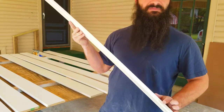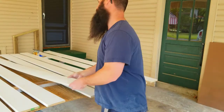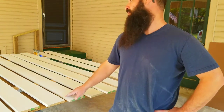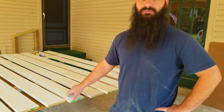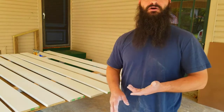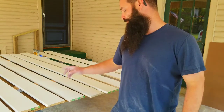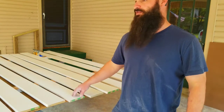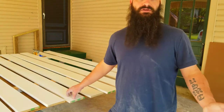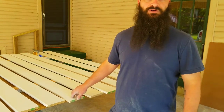There's a little thinness up top that paint will take care of. The order of operations: we'll pull the carpet, and I'm installing these just primed — I won't paint first because there are too many nicks and impacts during a carpet-removal job. We'll install it and then paint it once it's on the wall. I don't know if that's the definitive right way to do it, but it's how I want to do it. Thanks for watching — go ahead and subscribe.